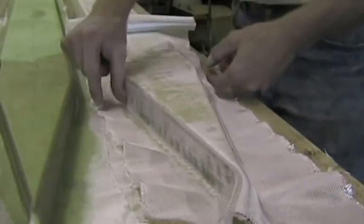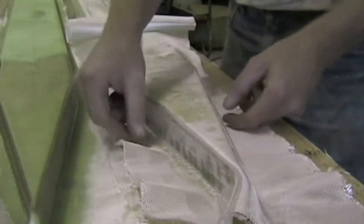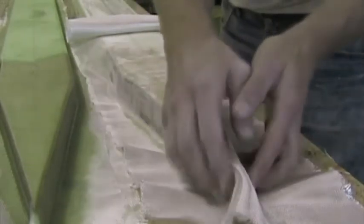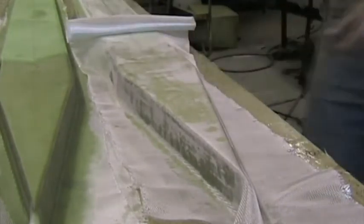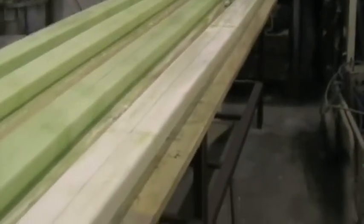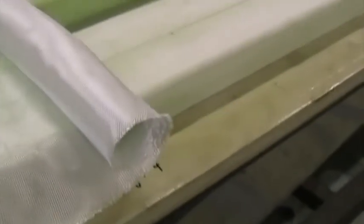We've got to ensure that we leave enough space here for the spar cap. This is 22 millimeters on the Express and 35 on the Motorglider here at the root end. This is where the first piece ends and the second piece starts. We're using the standard 25mm overlap that you can see there between the layers. And it's two full layers along the full length of the shear web. And then a third layer that ends as per the plan, over there somewhere, and a fourth layer that ends down here.